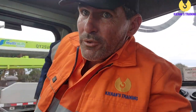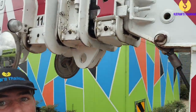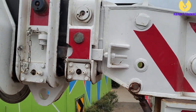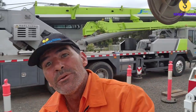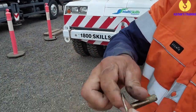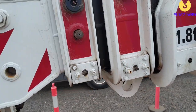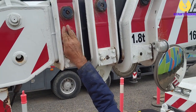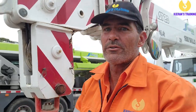And there you have it. All we need to do now is grab that pin from the boom head, throw that back in, and we're all set and back to normal. Grab the pins, go back up here again, straight through there and back over the other side. Make sure we put that retaining clip in — and all set to go back on the road again.